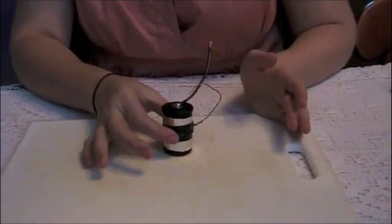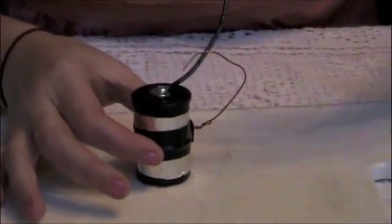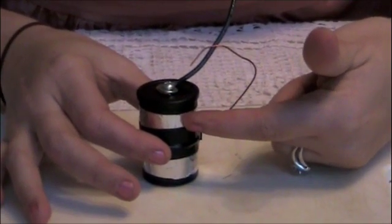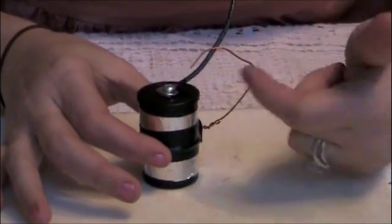You've got to be careful to only touch the insulated tape, because if you touch the foil or the wire you are going to get a shock. As the spark travels through the foil on the inside, through the insulating plastic, it's going to get deposited on the outside foil, which is touching the wire, comes back up through here, and it's going to discharge.